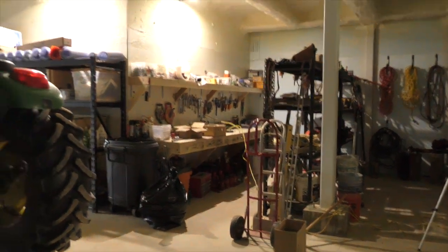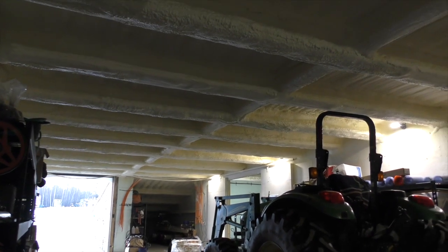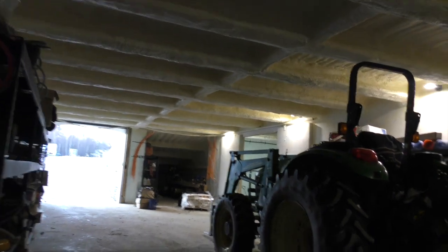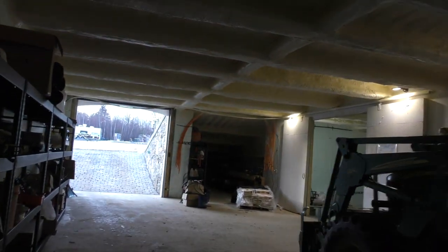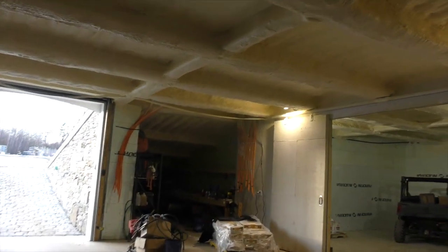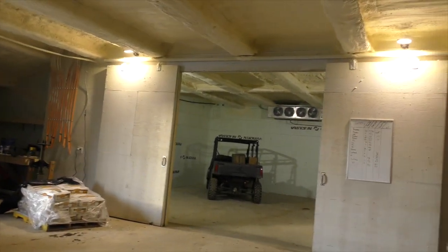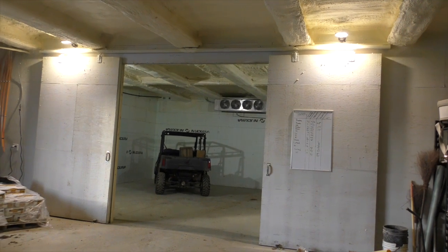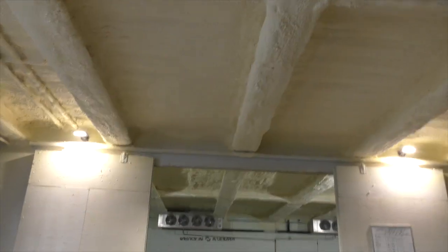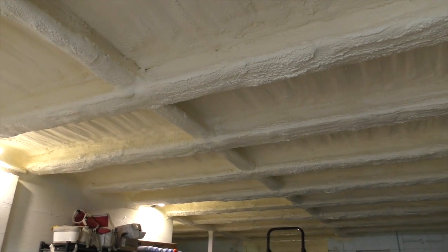Let's talk about supports. Fifty-foot steel beams — that's a huge span and that's a lot of weight up there. You've got all this steel decking and then all of the concrete, which is the new flooring for the barn, and you need to be able to drive tractor trailers through here to drop off equipment and supplies, put your tractors up there. For peace of mind and to make sure you never have to do this again, they doubled up on the steel.